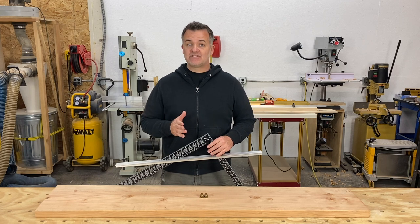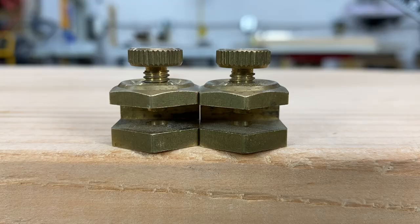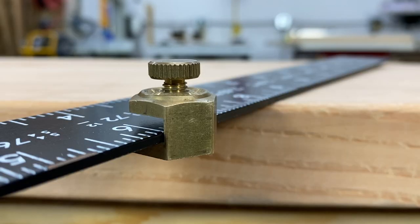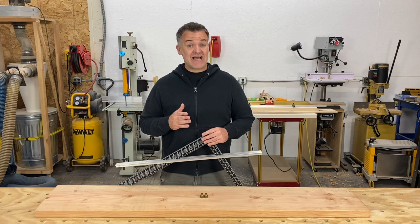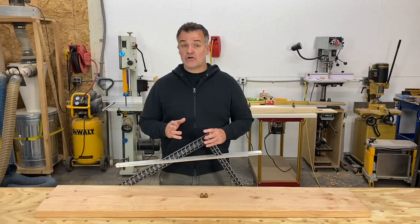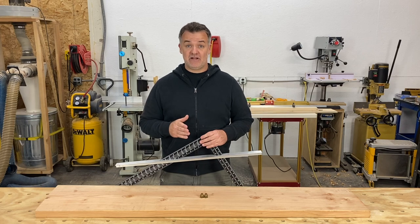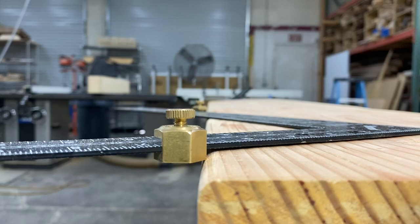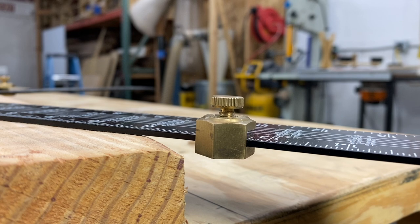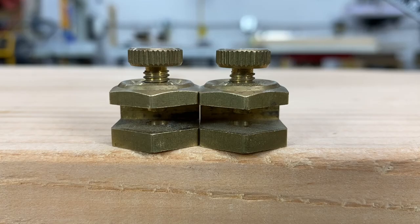If you work with the framing square and guides, you're probably most familiar with the stair guides. These clamp onto the edge of your square, allowing you to set your pitch and reference the square against the wood. While these guides do work, there are a couple of issues you can run into. For starters, the reference surface is usually only 5/32 of an inch. This doesn't give you a lot of bearing, and too much round-over, chipping, splintering, or waning in the board can affect the guides. Plus they're small and easy to lose.